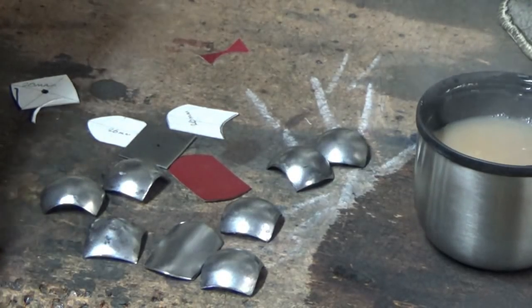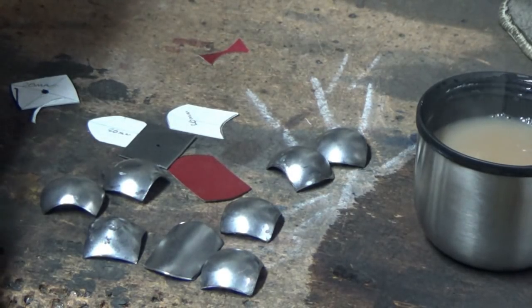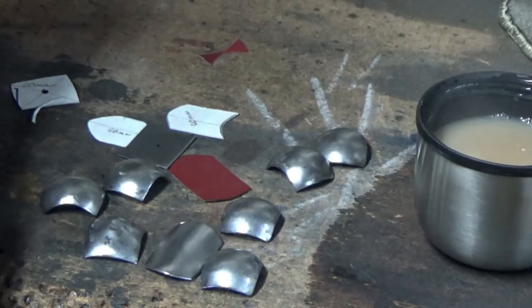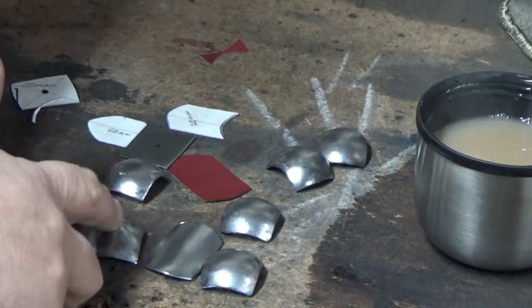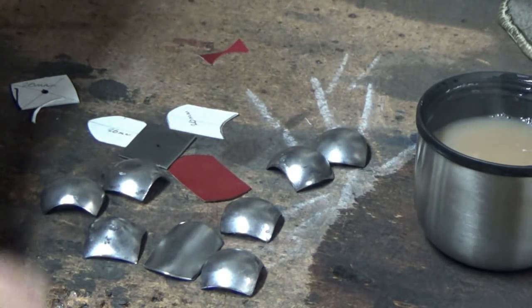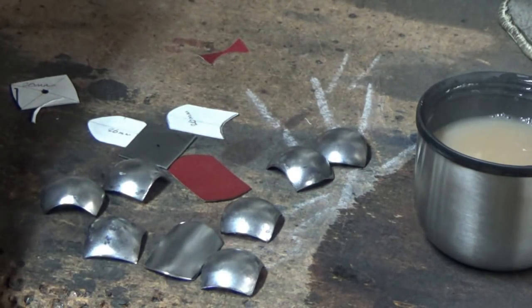It's really straightforward. The material I'm using in this case is very thin — it's 20 gauge, so it's about 0.8 of a mil. If you look at a lot of originals they are exceptionally thin, so much so they've broken through often on the top of the gadling where the material's been worked very thin. So beware: if you're making stuff for modern day sports you'll need thicker or stronger materials. You have to build what's appropriate for its end game.